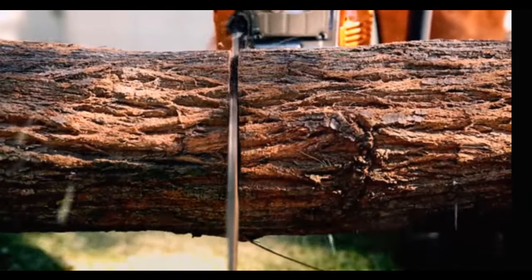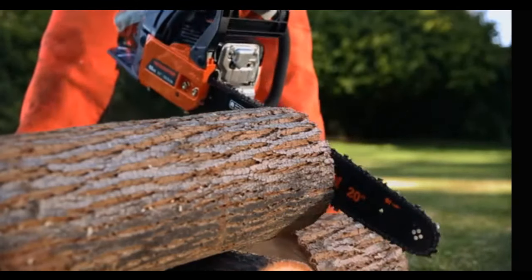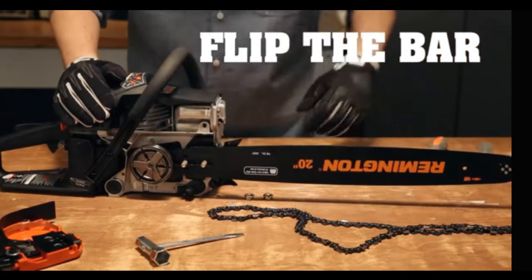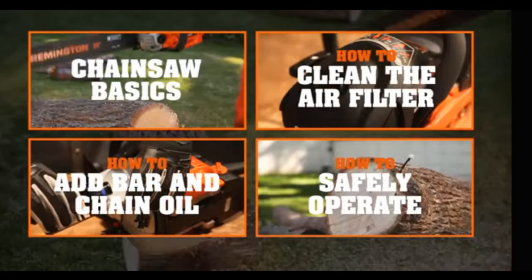After you've piled up a good amount of wood, the bottom of your chain bar will have gotten an unfair amount of wear and tear. So every so often, flip the guide bar upside down when you tighten the chain — you'll get more mileage out of the bar that way.